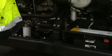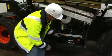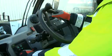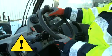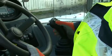When a low battery cannot start the engine, follow the Operation and Maintenance Manual for recommended practices that include jump starting from another power source. Be aware that batteries can create explosive gases. In no case should the machine be pushed or pulled to be started. Hydraulic and drive functions, including steering, brakes, and boom controls, are dependent on the engine for power.